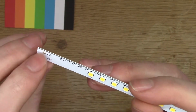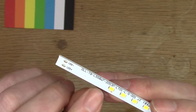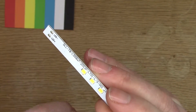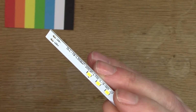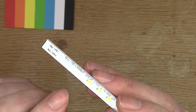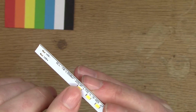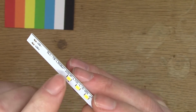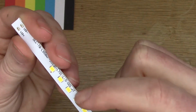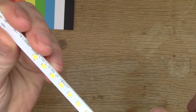So there's your ground negative and your positive. The positive rail goes all the way across, and the negative rail goes all the way across, and then here the positive connects into the first LED. Then there's a string, daisy chaining in series. All the LEDs are connected, and then at the last one it jumps over to the negative.